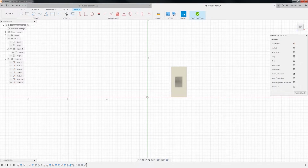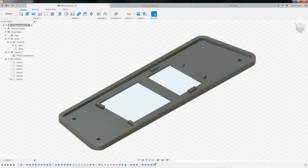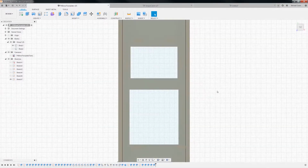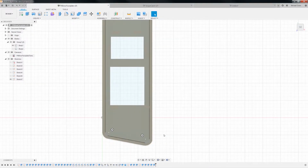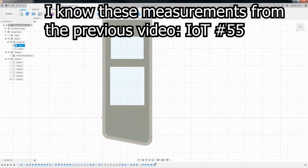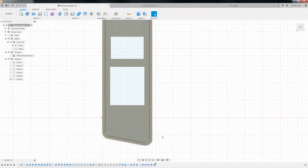All right. How big do we want our paddle? That's a very good question. Okay, so looking at it, I'll look from the top, it'll be a little easier. So we want the thing to swing out this way. So we know it's 10 millimeters there. We got another 4 there. That's 14, plus maybe another 10 millimeters. So it needs to be about 24 millimeters from the center of this hole out. So maybe include the center of the hole. Let's just add a couple more. So that's about 26 millimeters, right? That should be the same for all of them.